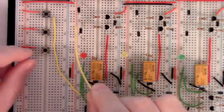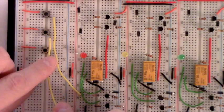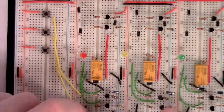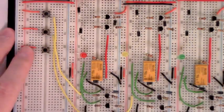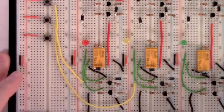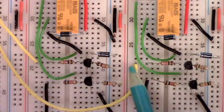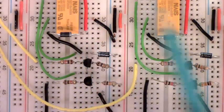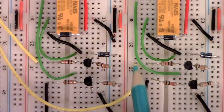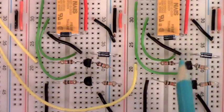We start out by adding a piece of wire into the row that the lower right-hand corner of that momentary button is located, and then run over to the row that this upper NPN base resistor is located. There's our second control wire — this is our latch wire from momentary button B. There's relay circuit A, relay circuit B, and there's the latch wire in the same row as the base resistor to the upper NPN in relay circuit B, running over to the row where the lower leg of momentary button B is connected.